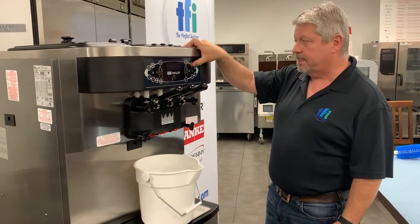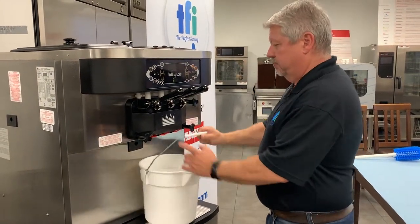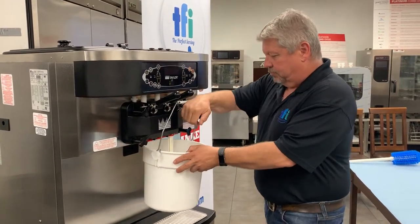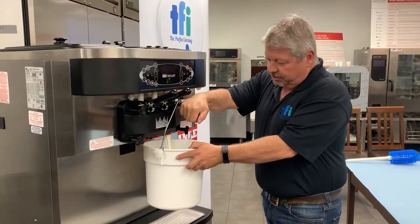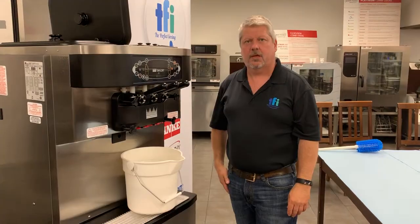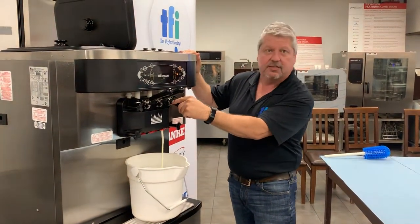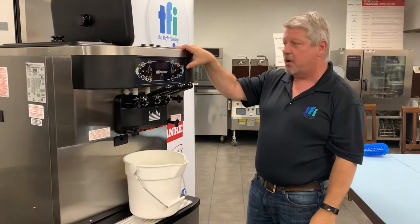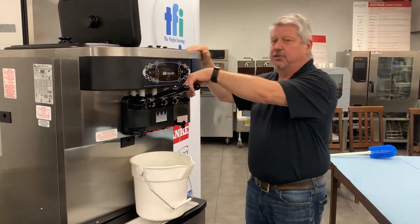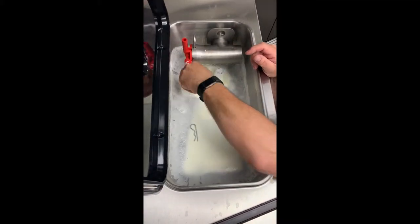We then want to use wash and pump to drain the machine. We have a bucket underneath the drip spout and we'll just drain this until it stops coming out, which depends on how much product is up and hot. I've been pouring the mix out for about two minutes and it's now liquid, so I've turned the pump off and disconnected the tube from the pump. It's faster that way — just using wash, I can let gravity and the parts turning move product through the machine.